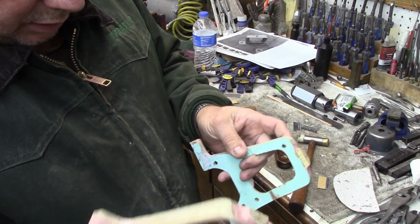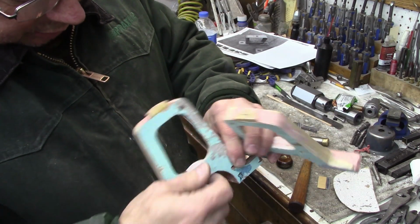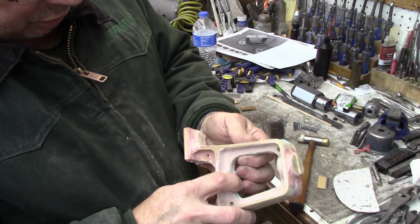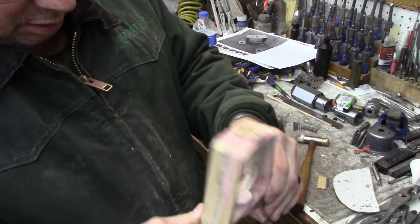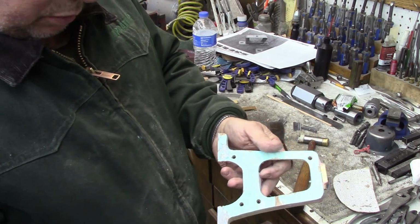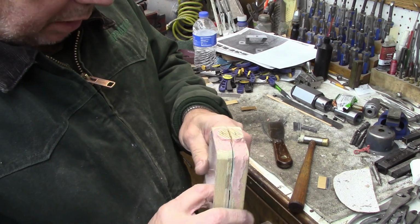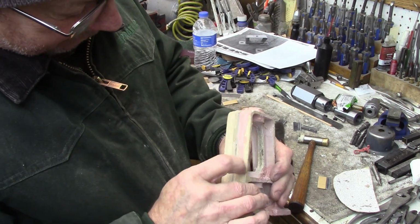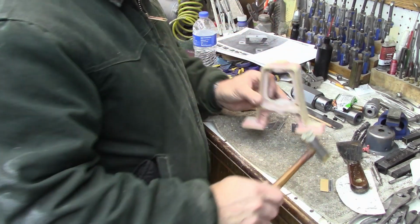So yeah, a little bit easier to do this way. We don't want to change our parting lines in here. If we're going to sand in between, we'll put some temporary dowels in there and sand them as a unit. But we'll probably have this pretty well sanded out and at least begin mounting it on a match plate tomorrow. So yeah, coming along. There we go.